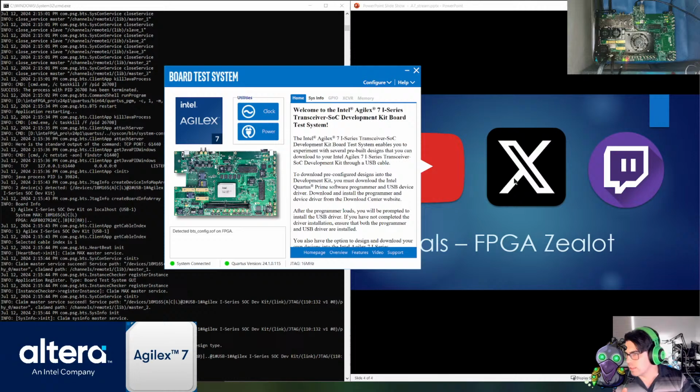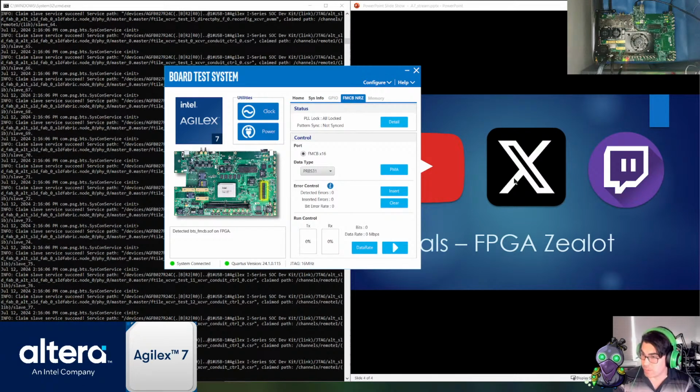So for the Max 10, if you download the files, it comes with a POF for programming it. If you screw it up, you can reprogram it with the POF provided by the system. But this would be specific to this hardware. I do not know of any generic POF file that would fulfill that, or a source for that.